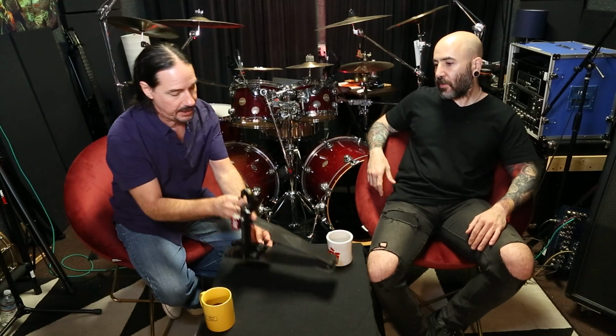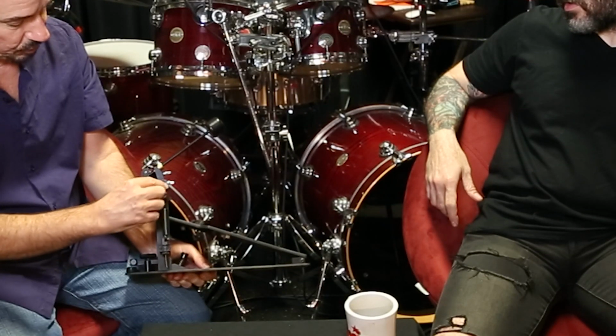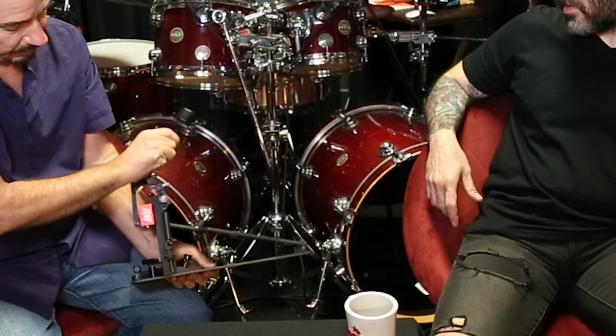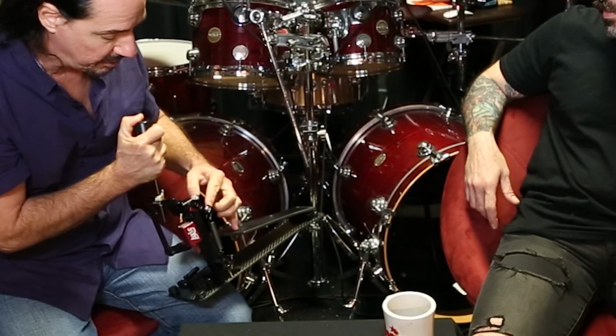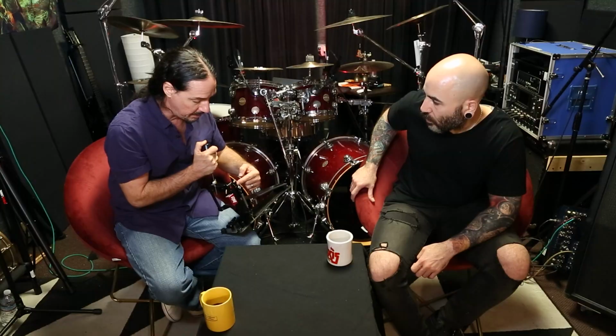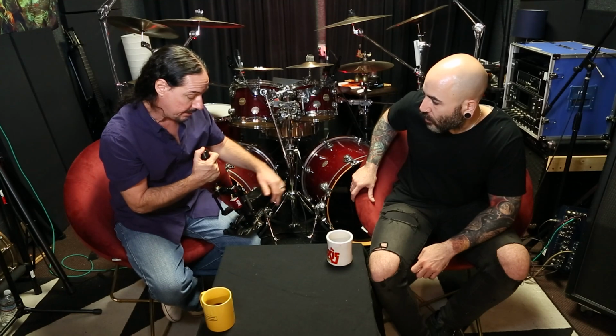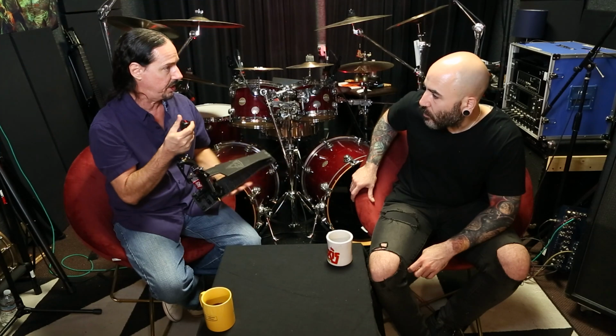I want to understand where did we get to do that and why? Okay, so that was another thing that I think Daryl figured out on paper. Yeah. Okay, so it's kind of hard to see on the camera, but when this thing is mounted up here, it has a shorter distance when it starts rocking back and forth than it does when it's mounted at the end of this. So what happens is when this thing stretches out, when it's mounted here, it pulls the spring a lot further than it does when it's mounted closer up towards where the actual axis is at, right? Yeah. So you're pulling the spring further each direction, right? So it was just a way to create a little more tension out of it.